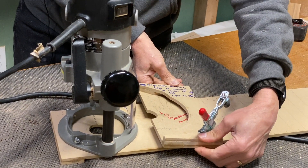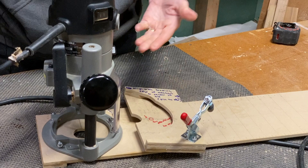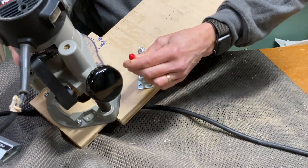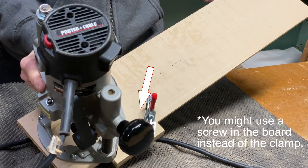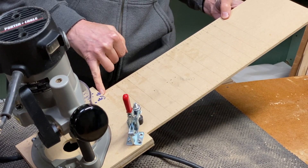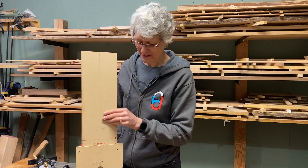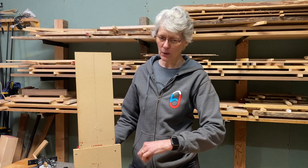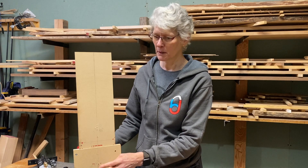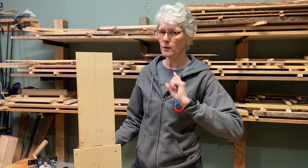If you make the outside wings a little more than an inch wide, you could probably bring it all the way up to about an inch from the center of the router bit. It locks in place with a clamp wherever you happen to want it set. I do have a measurement scale here that tells me how far it is to the center of the bit. For the centering pin, if you're routing a hole all the way through the board, your pin should be longer than the thickness of the board so that it goes into your backer board.